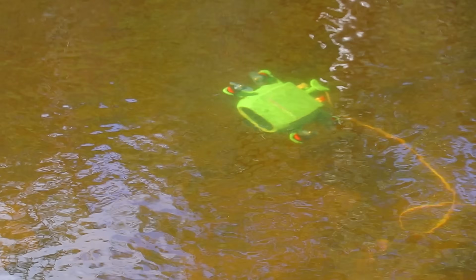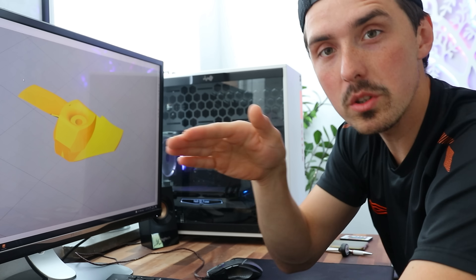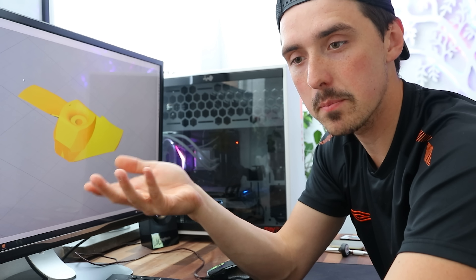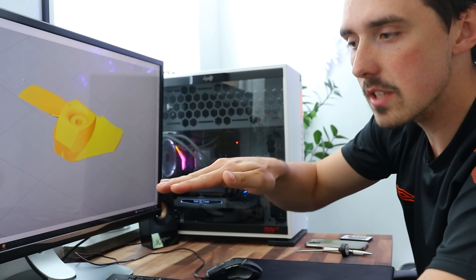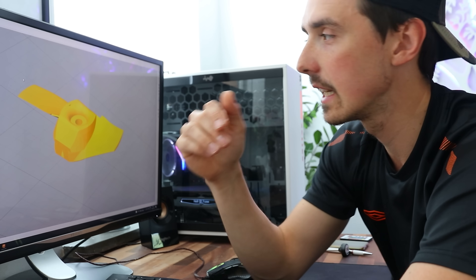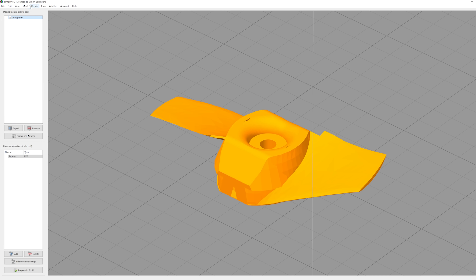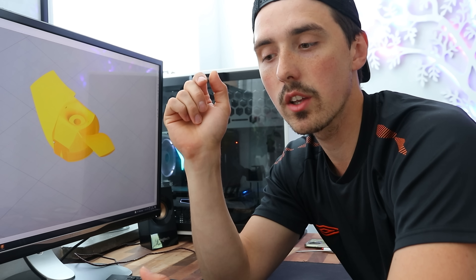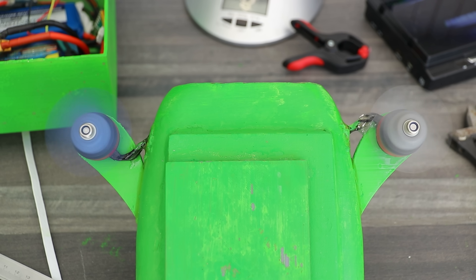Pay attention to this video — that's torque roll. That's what happens when both rear motors spin the same direction, causing the underwater drone to rotate in an aileron fashion. I can't counter it because the motor configuration only allows me to do rudder, pitch, and forward and backwards — I don't have this rolling action. So all we have to do is what every drone on the market does: use a reverse-reverse normal-normal propeller configuration to counter torque roll. All you have to do is go to mirror mesh and mirror Y, which mirrors the propeller. Then on two motors you swap the connections so they spin in the opposite direction — now they spin opposite directions but still push water the same way.